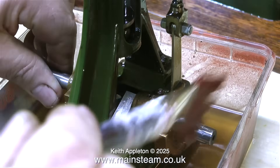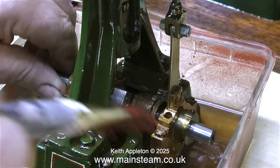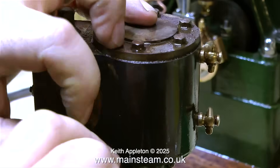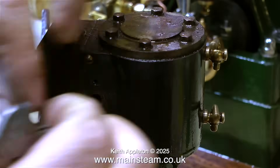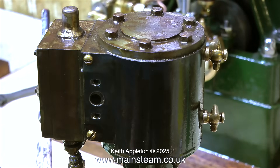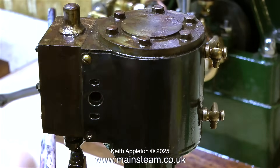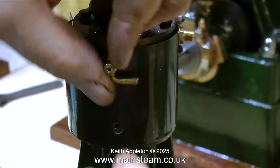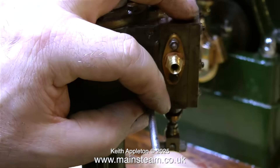As I continued working through the oil and grime, I noticed that the eccentric sheave and the eccentric strap were also varnished, so the varnish on these parts will be removed in due course. That's the bottom half of the engine done, now to look at the top half - the cylinder. The first thing I'm doing is taking off the exhaust flange, and this will then allow me to remove the cladding, starting with the two bolts on the left hand side. Thankfully these two bolts unscrewed very easily, which is not always the case. Now round to the front and I unscrew the drain cocks, followed by removing the two screws from the other side of the cladding.